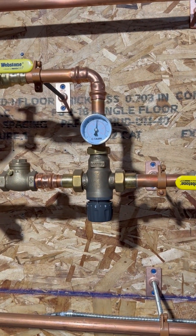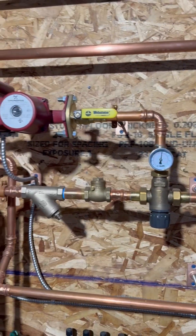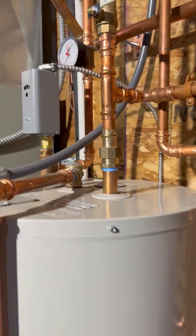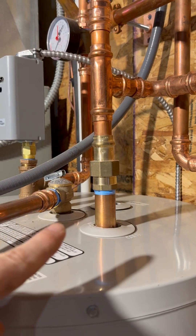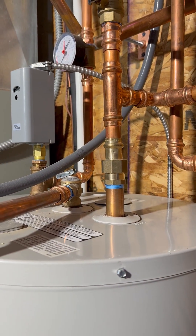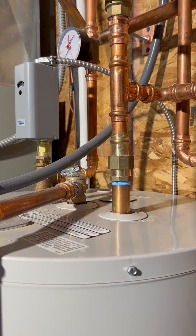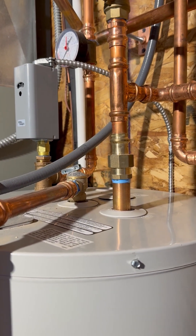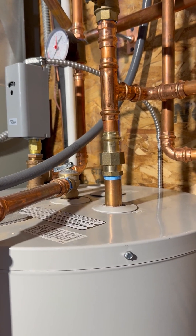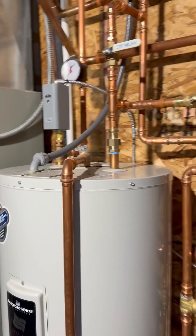Right after that you have the pump, which only kicks on when it's calling for heat — that's another advantage of setting it up this way. I also put in a union here so that the fill tube can be replaced or accessed. I didn't want a plastic fill tube, so I soldered on a piece of five-eighths copper to the brass nipple. There's no plastic in this water heater at all.